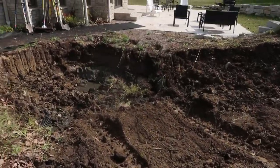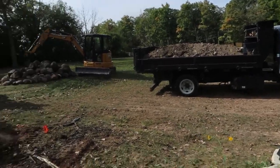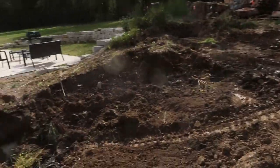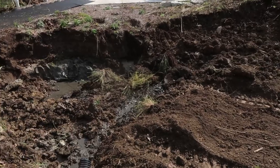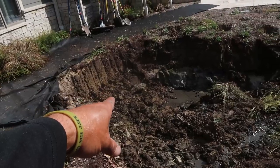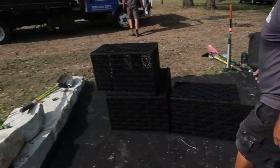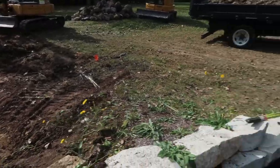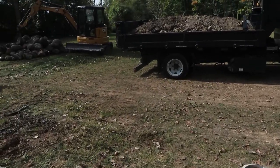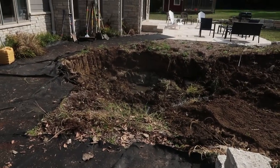The pond is ripped out. We need to bring in at least two trucks' worth of fill — we brought one out, and Jack just went to empty the other truck of all the garbage we pulled out: all the cattails, all the muck. We left a little at the bottom, which is fine because the bottom of our reservoir only goes to that little shelf right over there. The guys have got all the aqua blocks built. Next step is dumping fill, backfilling into this hole, placing the reservoir, setting our ten aqua blocks, and locating our pump vaults.